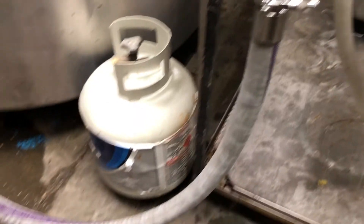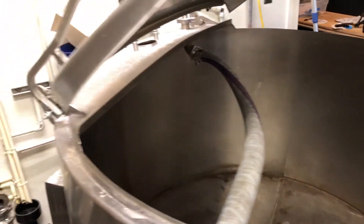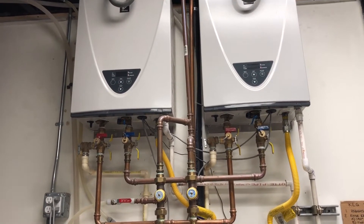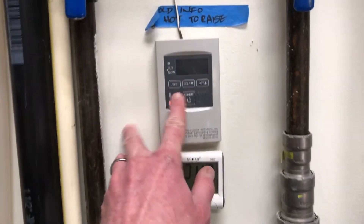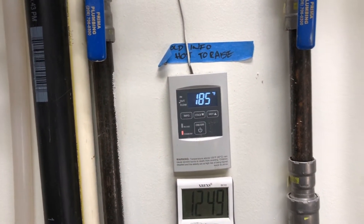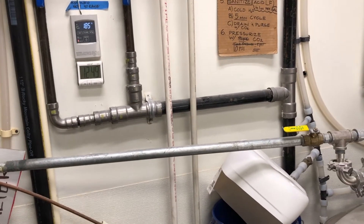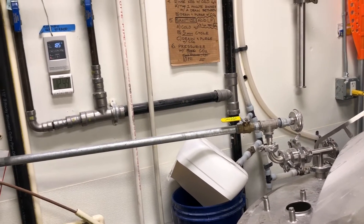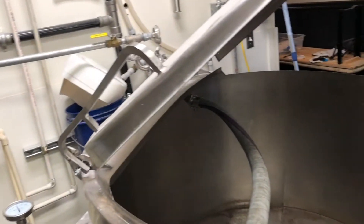The water in right now goes to my mash tun fill line — it's just the easiest spot to bring it in. That goes through a valve and into our on-demand hot water heaters. If you're starting a brewery, get on-demand hot water heaters — they are the greatest thing in the world. We've got our water set to 185°F. You want it as hot as you can get it: the caustic solution hot, rinsing hot, and for sparging and filling I can get water up to 185°F right at the brew house, which is critical.